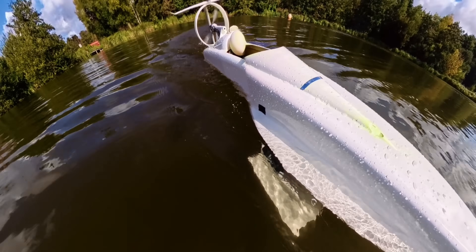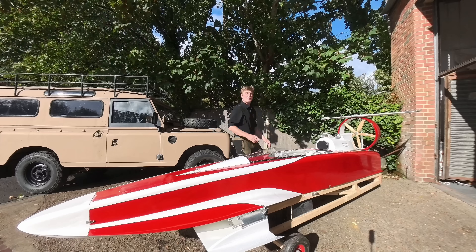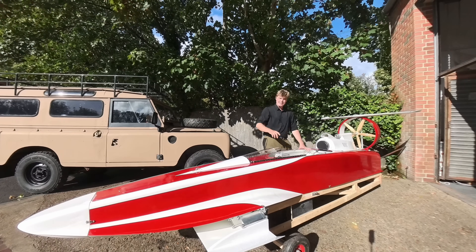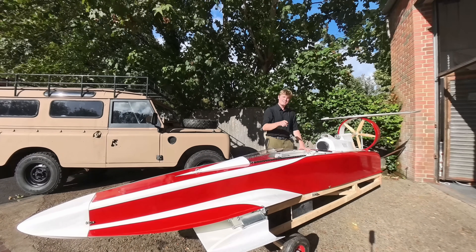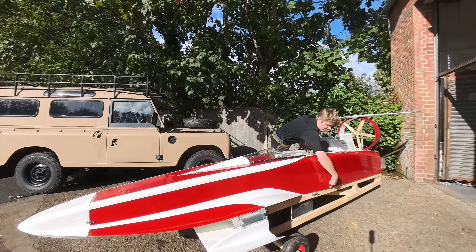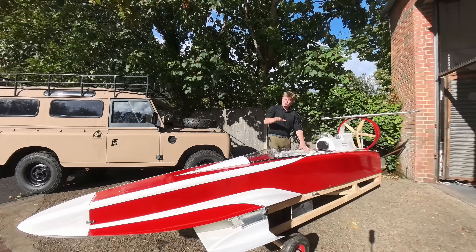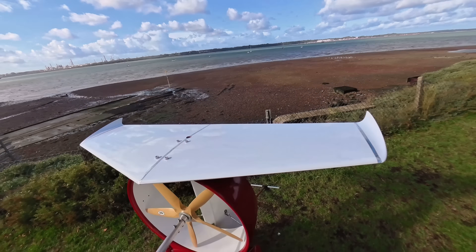The really hard bit is keeping the boat stable and controllable. Aerodynamically, the boat is stable — that is to say, the center of pressure is just behind the center of mass, here, just behind there. So the boat wants to stay level and it wants to go in a straight line. That's what that big fin does.